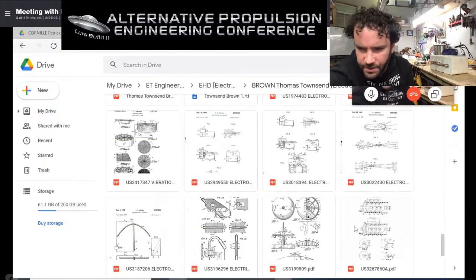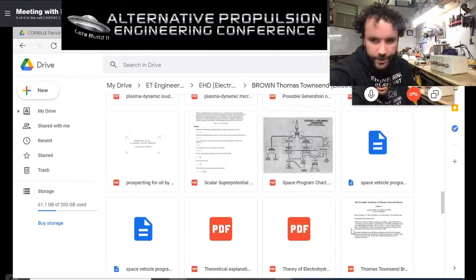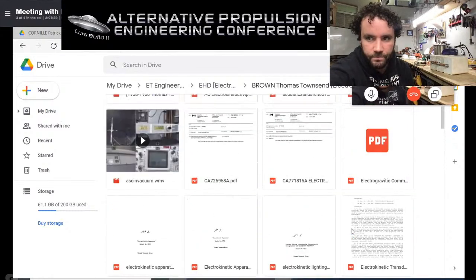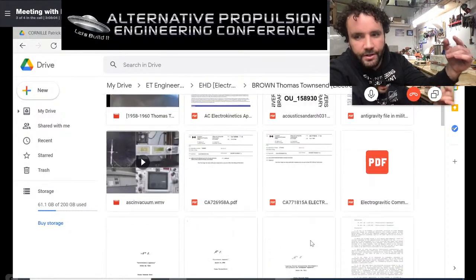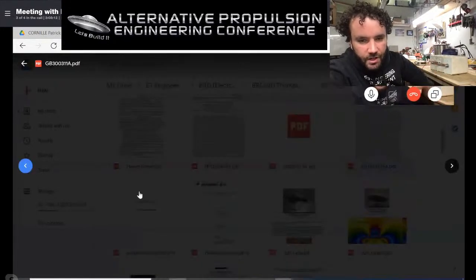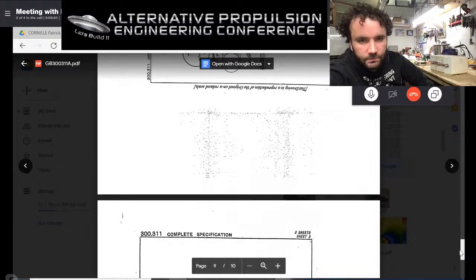Somebody else mentioned you should get superconductors. We do have superconductors. We're using those for different experiments. If you're talking about making a superconducting coil, that wouldn't really fix the problem here. The problem is that we're putting such high current into the coil that the potential between one piece of the wire and the other, even though there's only like 1 ohm difference between them, is a very high voltage because of the high current, and it's able to jump the air gap. So technically, superconductors do solve that problem because there is zero potential between the in and the out.